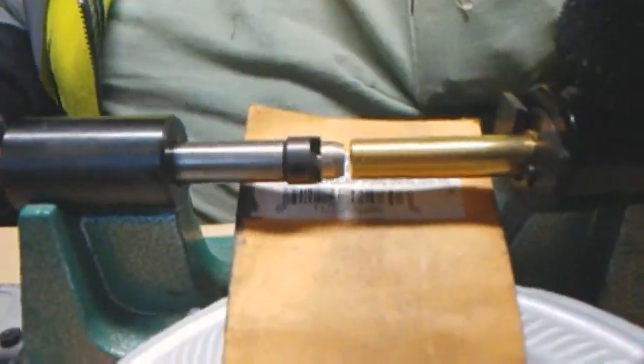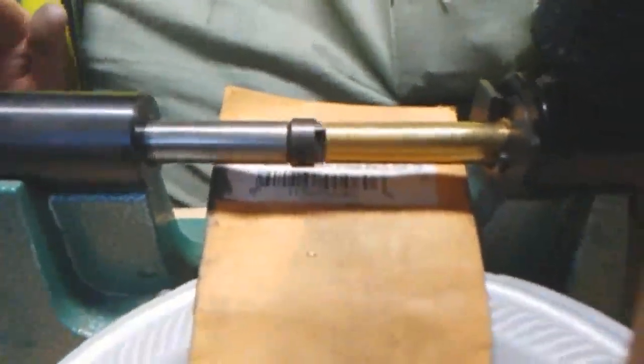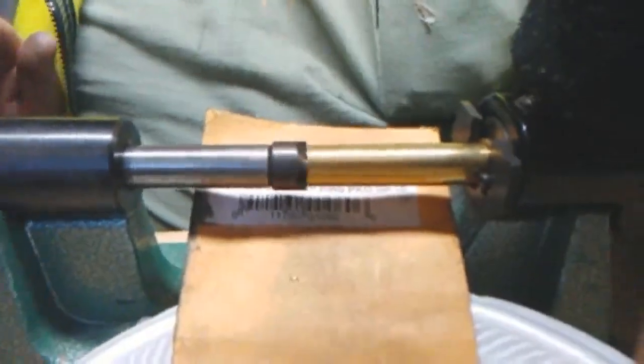Put it there. I'll turn my system until I get that set screw up, line it up with that tick mark on that light, on that shaft. I want to come back in two more. There's two more tick marks. That way, turning it towards me is going to shorten that up. Now let's see here. That just took probably about 2/1000ths of an inch off of that case.